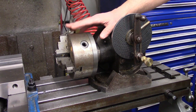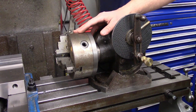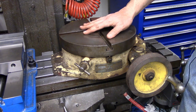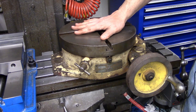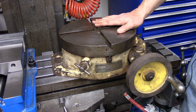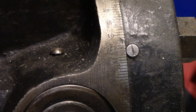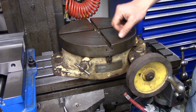The dividing head can be used to cut gears, graduations, splines, wrench flats, or any feature you can imagine around the circumference or the face of the part. The rotary table is similarly versatile and can be used to machine radii or features at angles to one another. You can mount fixture plates directly to the table, or you can actually mount chucks to them as well. Many rotary tables can be mounted both horizontally and vertically, and most dividing heads can be set at an angle from 10 degrees below horizontal to 90 degrees vertically. I have a playlist of videos on indexing devices that I'll link to down in the description.